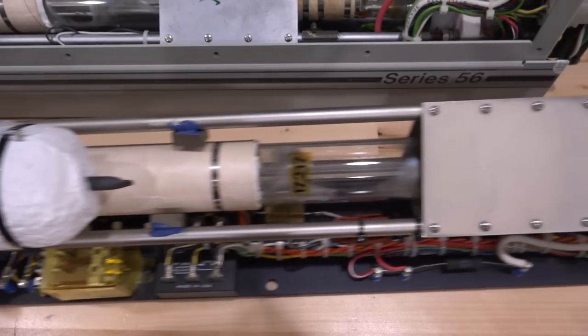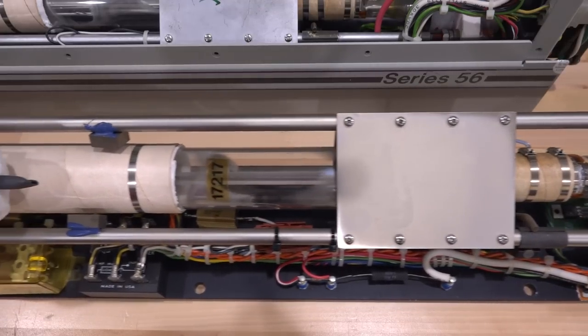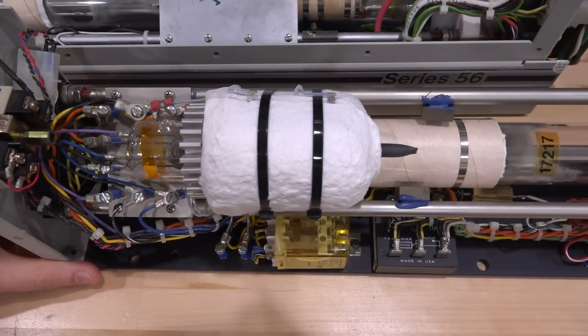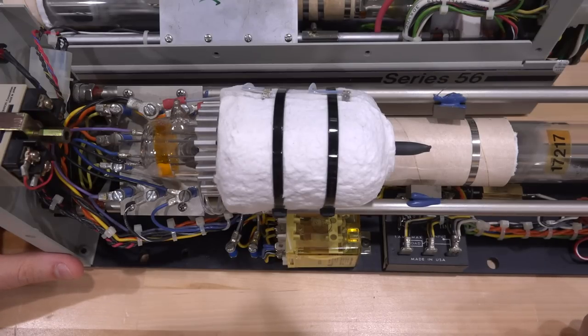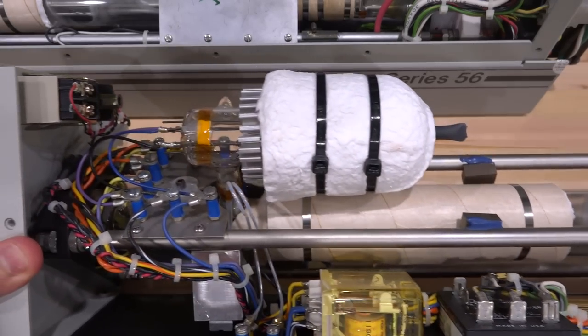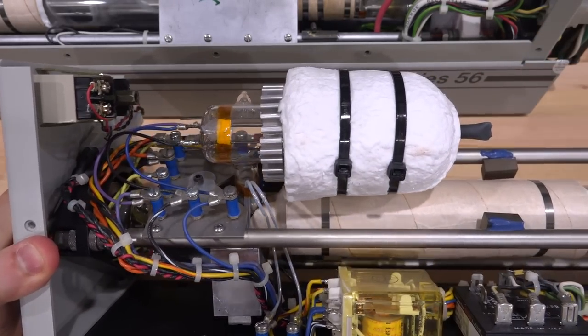There is one other thing that happens in these lasers: there's a button called 'cadmium melt.' What happens is that if the laser is turned off prematurely — because there's a very precise shutdown sequence you have to follow otherwise you can damage it — cadmium vapor in the entire chamber can quickly deposit in places it's not supposed to, like on the mirrors. In that situation you can turn on the cadmium melt, which heats everything to a very high temperature trying to melt and evaporate the cadmium off the mirrors and release it back into the chamber. It's a last resort, and I think that's what this relay is controlling.